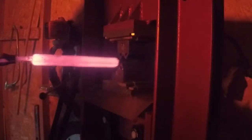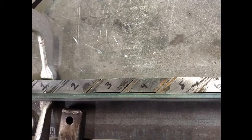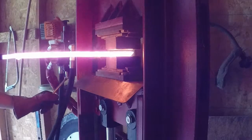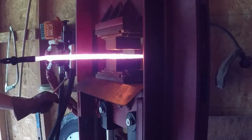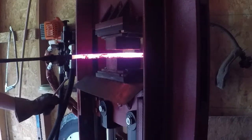We're close to the end of this welding pass — you can see the dies are coming almost completely together. When they do, theoretically I've got a perfectly square one-inch bar, though of course nothing's that perfect. When I'm done here, I'll cut this bar up diagonally at 45-degree cuts, with pieces a little over a half inch thick measuring the thinnest dimension. Then I'll flip those 90 degrees and tack weld them together with a MIG welder, throw them back into the forge, get it as hot as I can, and forge weld again. Here you can see the first passes at the bar — just kissing it, seeing just a little bit of reduction, making sure the center is as hot as the ends before getting more aggressive.